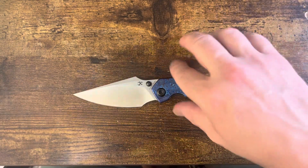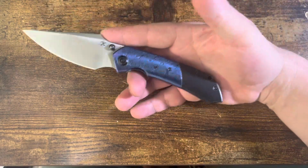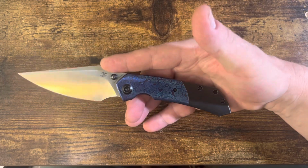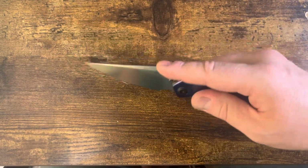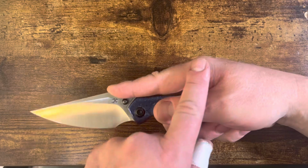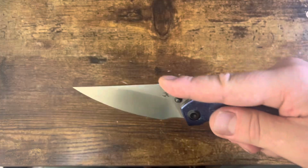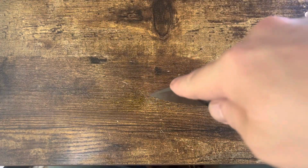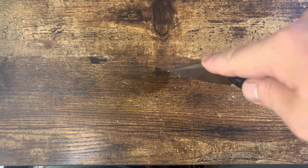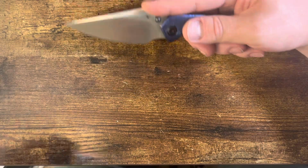And with this tucked handle, instead of being a long, slender handle, I'm holding it to show you how it goes. The finger goes right there. This thing tucks back into the blade. And now you have a very useful grip, and I don't know if you can see just how direct that line is from your finger down to the point, but I know exactly where that point is. It's just right at the end of my finger. Once you know how far away it is, you know where it is. You can get it like this, but if you go back and you need to do score cuts, your hand is out of the way, way back here. And there it is.